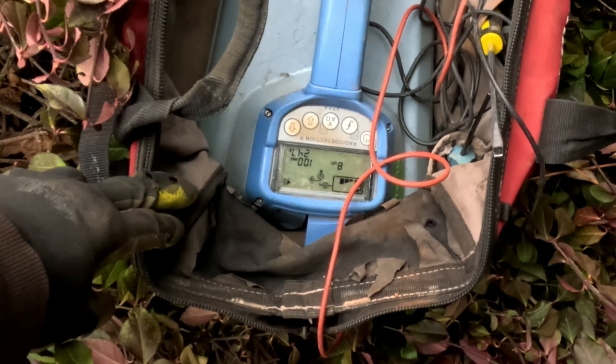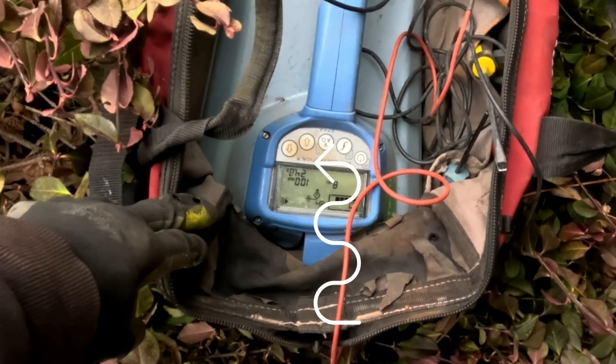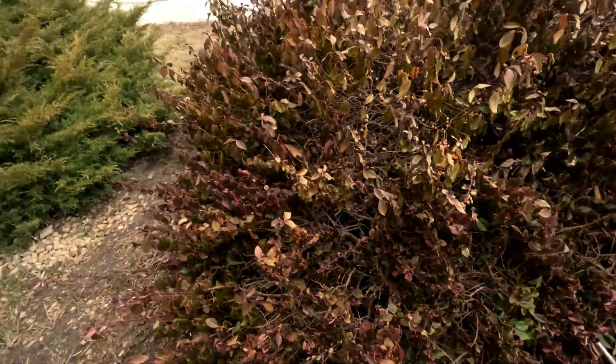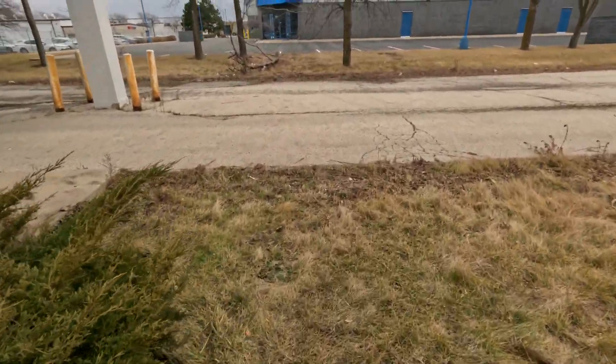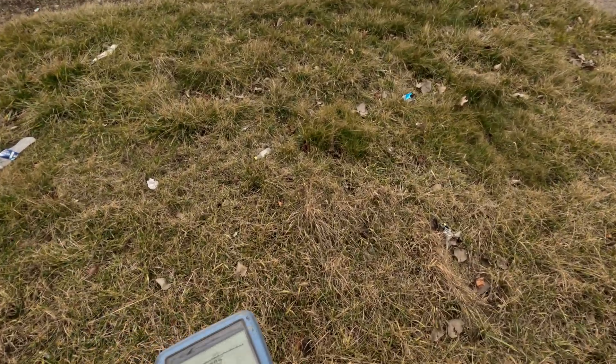Pushing out 100, but you see my voltage is up there at 24.8 — so right there I got a resistance on this line. That's most likely what the problem is, why I can't walk it back to the pole. Let's see how it tones out from the other end, going back to the pole. I'm gonna do a quick sweep.